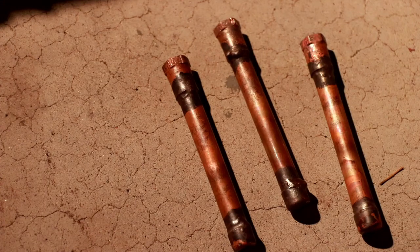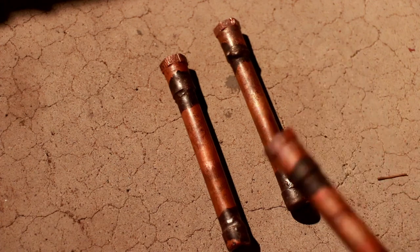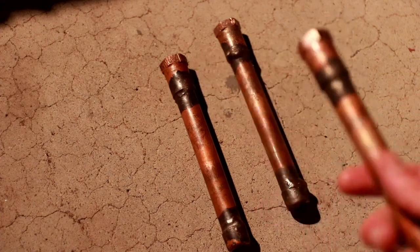So keep in mind there are hazards involved. You can be burned. The open flame can present a fire hazard. And if you do this in an indoor or confined space, there's a risk of asphyxiation or carbon monoxide poisoning. So ensure that you have adequate ventilation and that you use the necessary precautions to ensure that you aren't injured or don't cause any property damage while working on whatever you're using this brazing technique to do. And like I said, I'm not an expert, so I'm not responsible if you destroy your air conditioner or whatever else you might be brazing due to a faulty braze joint. I also wanted to mention, like I said, you want to use an inert gas if this is going to be used on any sort of a closed-loop system or anywhere that contaminants from the oxides that can form inside the pipe would be an issue.